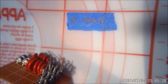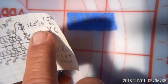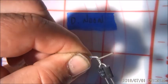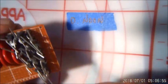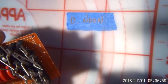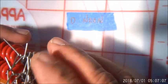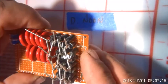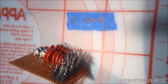I wanted to get 178 volts total, so I got a 160 and an 18 volt. The 'CA' means it's bi-directional. I just twist them together — that way I have 178 volt capability — and I just drop them in the holes and trim those off. That gives me some nice bi-directional transient voltage suppressor diodes. That's how I make mine.